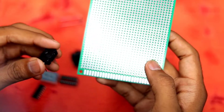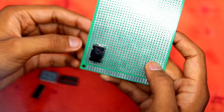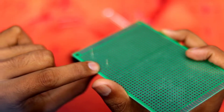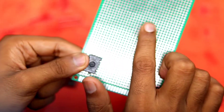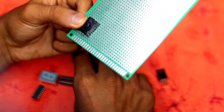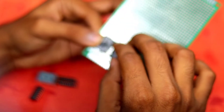Let's start building. First I'll mount the switches — I've already calculated their placement for better symmetry. I hold each one in place and apply solder to both joints. The board is nicely tinned so soldering is not an issue.